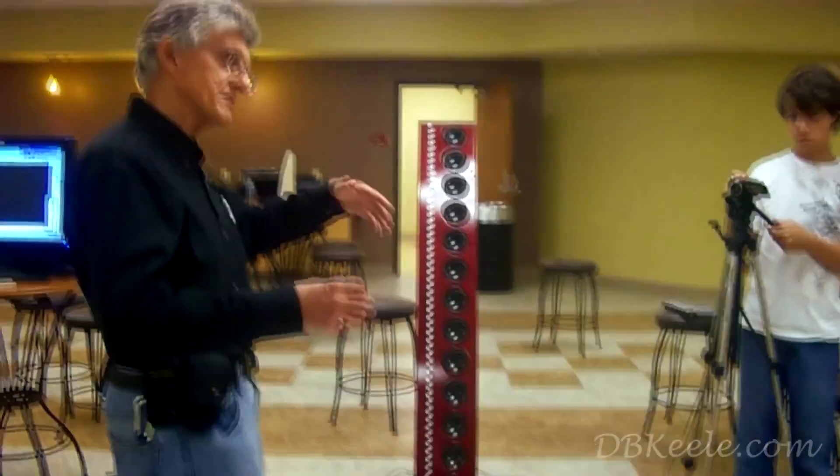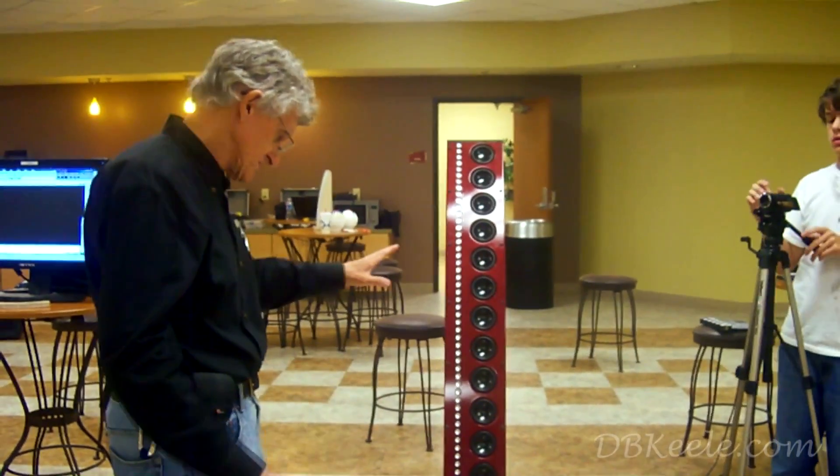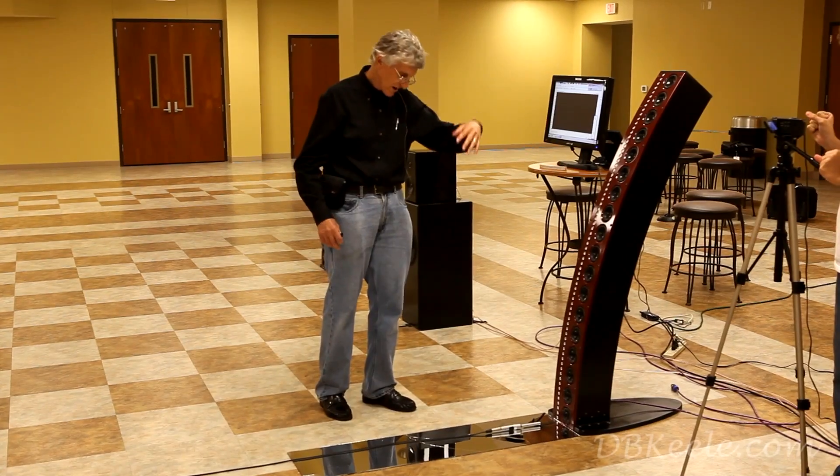This is specifically intended to operate over a reflective floor or ground plane. You can often say that it eliminates ground bounces, but it actually integrates the ground bounces into the total system and in effect doubles the size of the array.